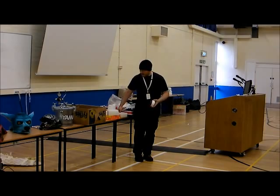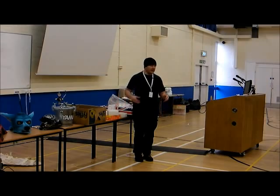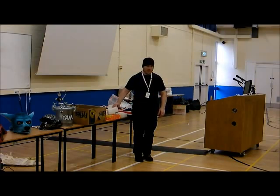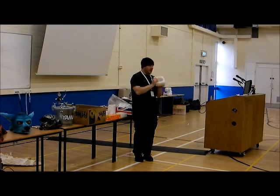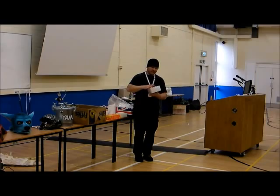And then, whilst you're making that, you do a second mould. What you do is you get two of the objects. So I got two of the lids, glued them together, and made a mould of that. Because the two weren't perfectly in line, one was standing proud of the other, so the theory is there will be a gap of air between the two. If you look in that mould, there's a little wall all the way around, where basically the bottom one was sitting.